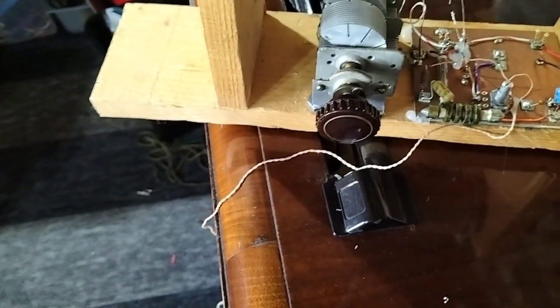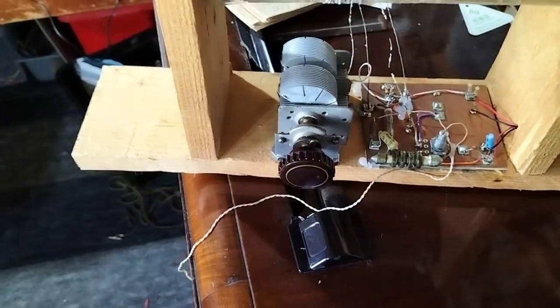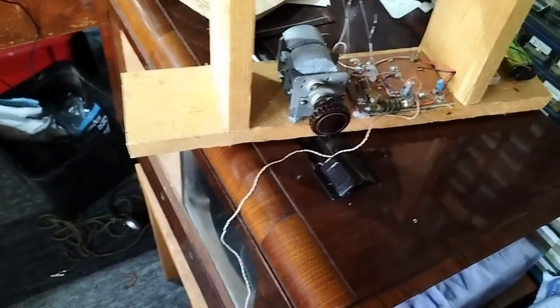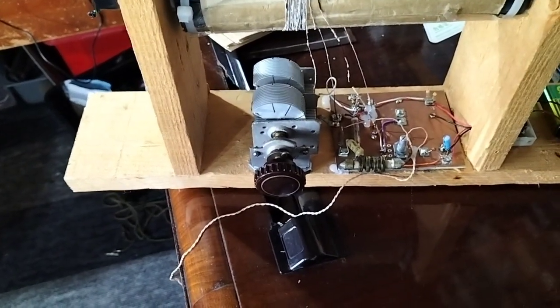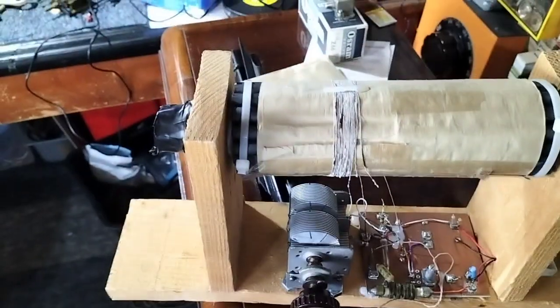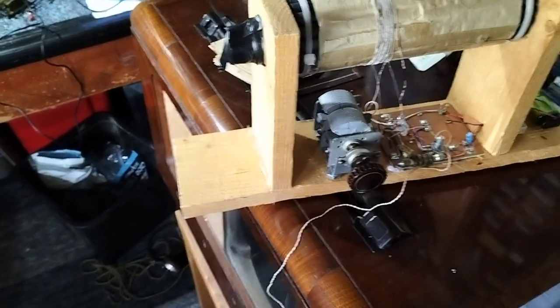I'm not using the leaky grid detector — they don't work that well in these valves, so I decided to do it this way. It does work okay; I wouldn't say it's blastingly loud, but for one valve with no other antenna except the ferrite sleeve antenna, it's actually relatively good and picks up what's left of medium wave.